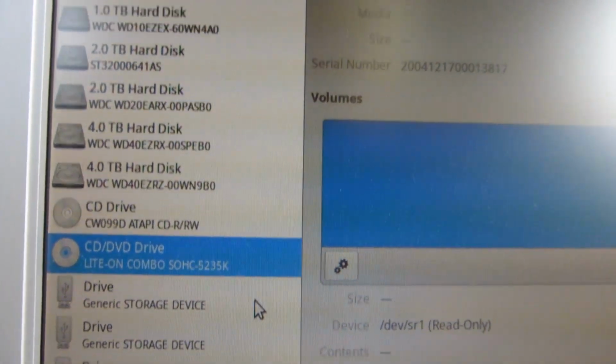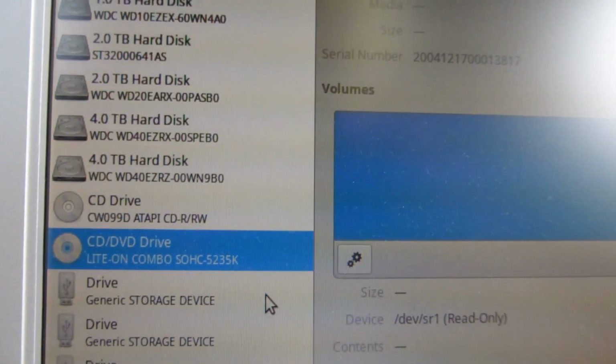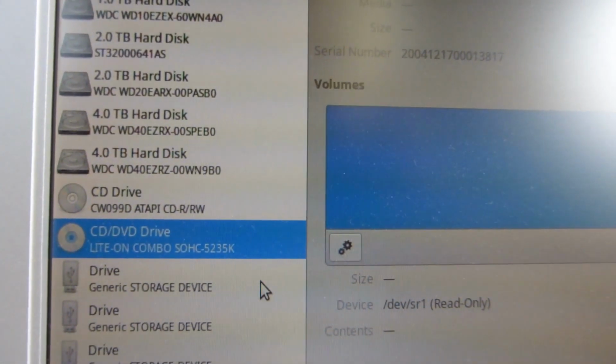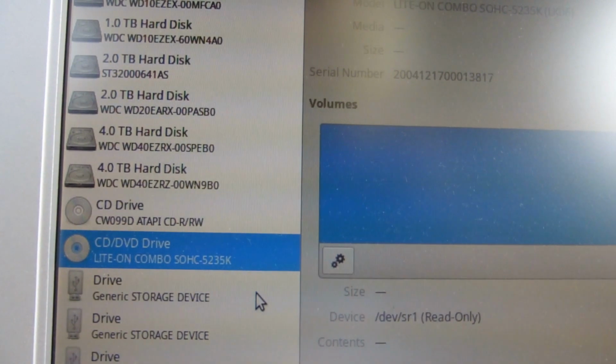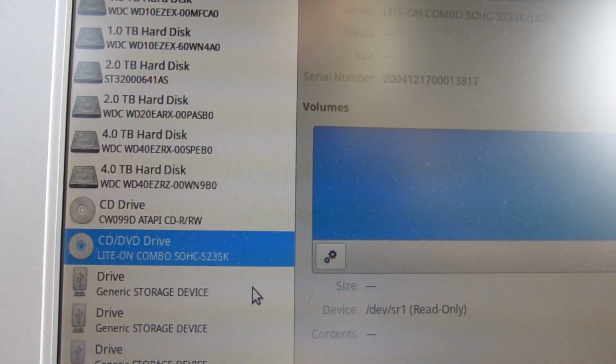And I would suspect it's those capacitors because, well, it's the first thing to suspect, and it's the thing that I can do the most with. I mean, it could be that the BIOS on that card is corrupted somehow, but if it was, that would probably be because of the capacitors. So maybe I'll need to replace the capacitors and reflash the card. I don't know.